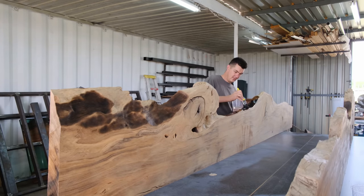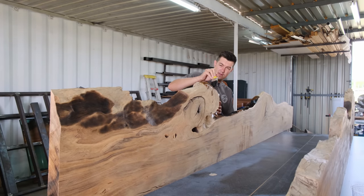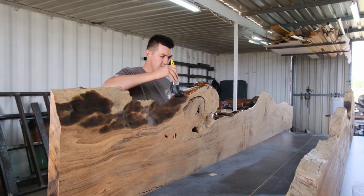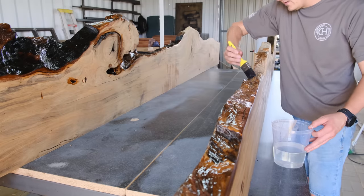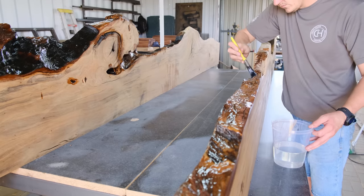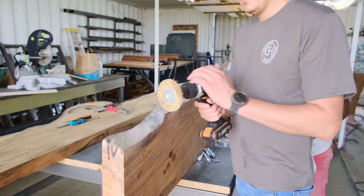So what I'm basically doing now is sealing my edges, and this is an old method we used. We are moving to a complete new method, and I will explain this to you later on. What we are doing here is sealing our edges with epoxy, then waiting for the epoxy to dry, then scuffing it up with a steel wire brush, to reduce bubbles. But a new method we're using is we will seal our edges with epoxy, put it in our epoxy mold, wait for the epoxy to become tacky, and only then will we cast our epoxy.